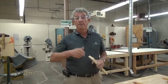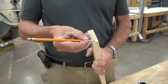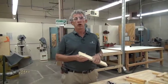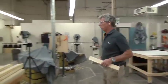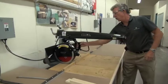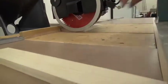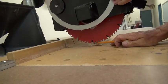Certain things go quicker — I'm going to go over to the radial arm saw. Here we have our piece of wood, going to make some cuts. Radial arm saw — you've seen the demo, you've passed the demo. You're ready to use it, otherwise you wouldn't be making wood joints. I'm going to put my wood underneath, lift up the guard. I want the blade at the bottom right there and I want to touch that line, so I'm going to drop that down a little bit.